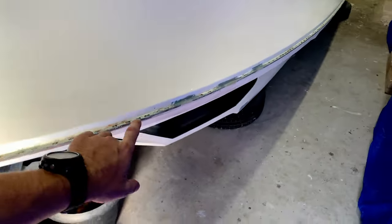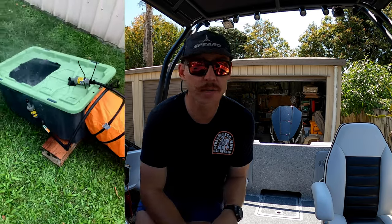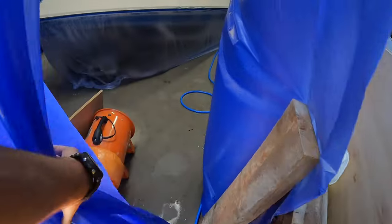Gel coating! I lined the shed with drop sheets. I bought myself a ventilation fan with five meters of ducting going through what I call a scrubber box. We've got scrubbers on some gear at work — they work by just adding water to dust to knock the dust down. So I figured something similar would help break down the gel coat mist pumping out the back of the ventilation fan. I made that little scrubber box up with some sprays on it, and on actual spray day I put a tarp over the top of that as well. That helped capture the little bit of mist still coming out from the sprays and the force of the fan.